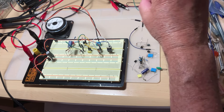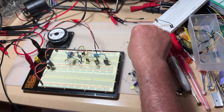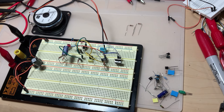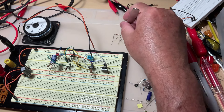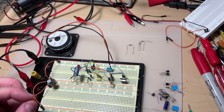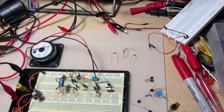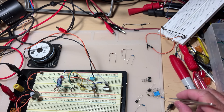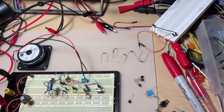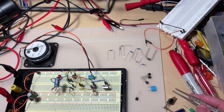Identify the resistors from smallest to largest: 100 ohms, two 1 kilohm resistors, one 2.2 kilohm, one 6.8 kilohm, two 15 kilohm, one 22 kilohm, and finally one 27 kilohm. If you have any doubt, use a cheap multimeter to identify them. Put the resistors aside.